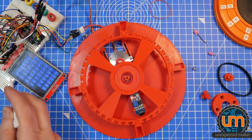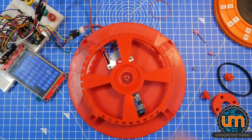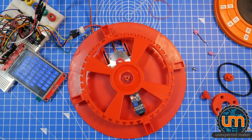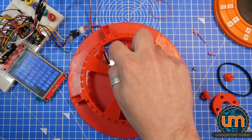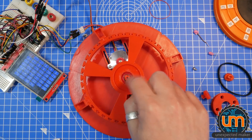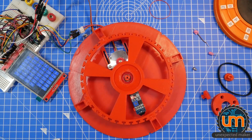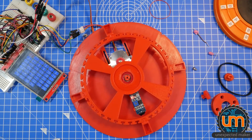I personally could live with a rattle and might just leave this. But part of me wants to see what it feels like just having the motor in the middle. To get all this to work I literally took a chisel to the base and hacked it to get the motor closer - the motor wasn't designed to be this close. This top section is actually sitting just on the top of this motor and there's rubbing going on. I need to play with some tolerances and get this a little bit higher - half a mil or a mil. I could do that by lifting the bottom gear. Building gears in Fusion 360 was fun but not my favourite thing.